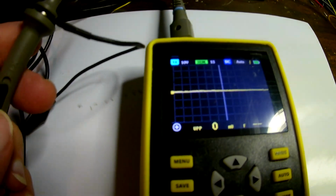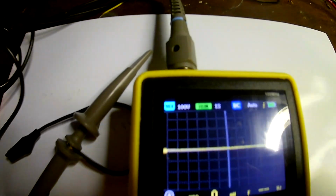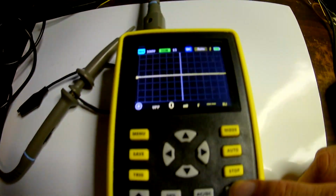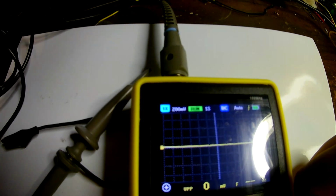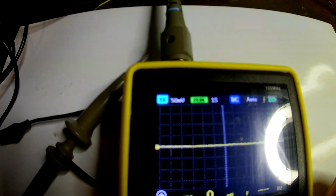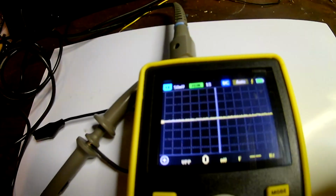And of course, if you change it here to 10x, there's a setting down here you have to set to tell it's on 10x, and then it changes that accordingly. So that's 100 volts it goes up to on the 10x scale at the maximum. And if you switch this probe to 1x, then we can go down to, well, it's the opposite of what I think, up is actually down. 50 millivolts is the smallest setting in the vertical direction,